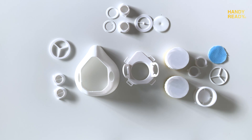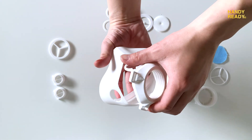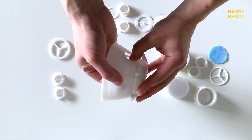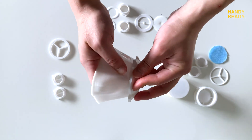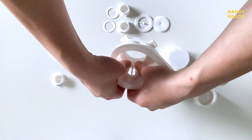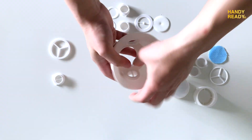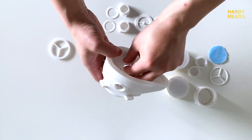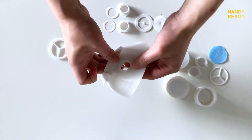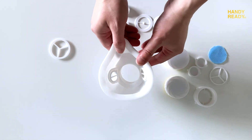With that in mind, I have decided to modularize into different parts because: A, you can print different parts with different filaments and different materials; B, it is easier to make improvements for parts in the future; C, breaking into parts does not require support on printing; D, the components are easily replaced if they are broken or worn out.